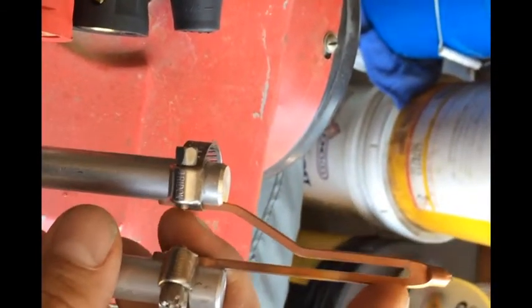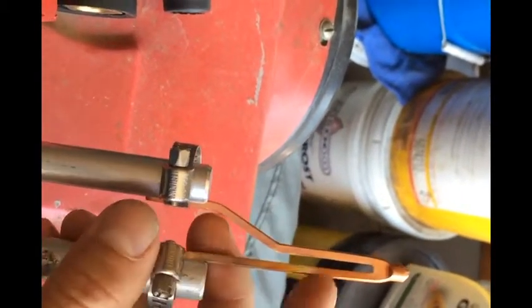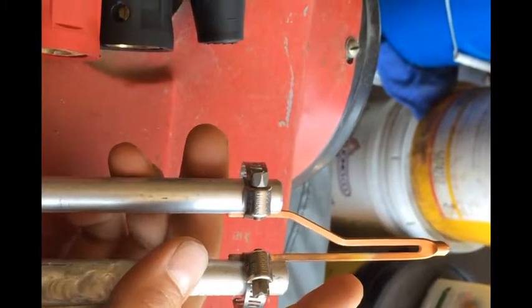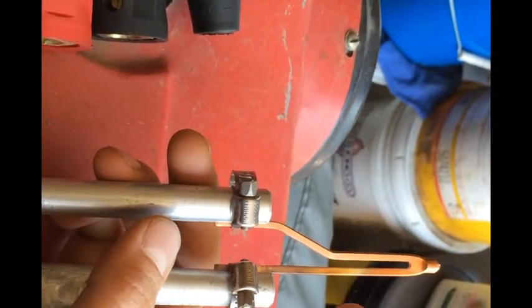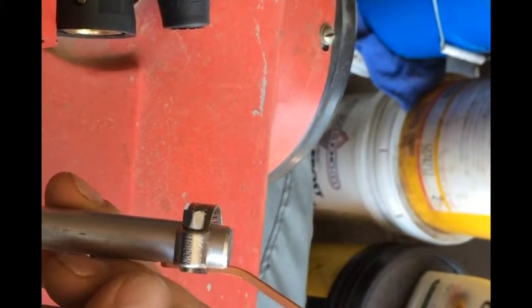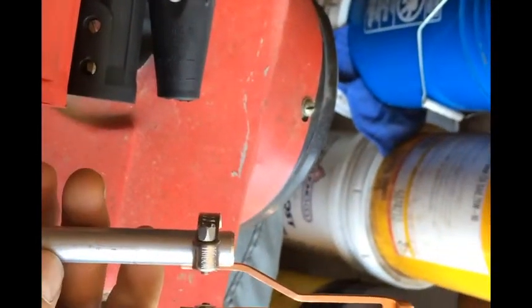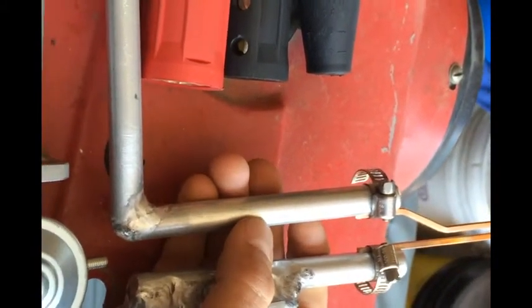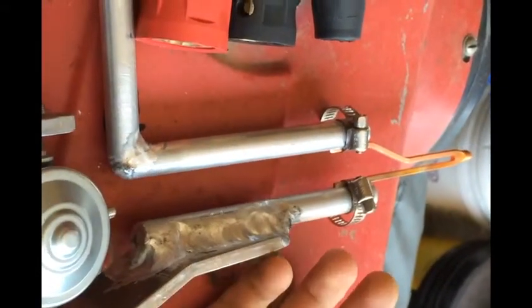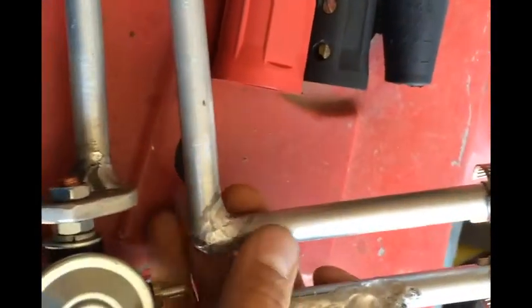These tips are pure copper and there's very low resistance — I can't even measure the resistance with my standard multimeter. With really low resistance copper, it takes a lot of amperage to get this thing hot. So that was my failure: I thought, hey, it's a big welder, it's going to get the thing really hot. It didn't. And that little 100-watt gun puts out more amperage than that 200-amp welder did. It's counterintuitive, but that is the electrical theory behind it.